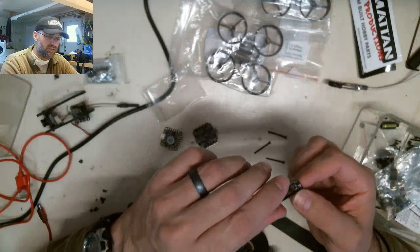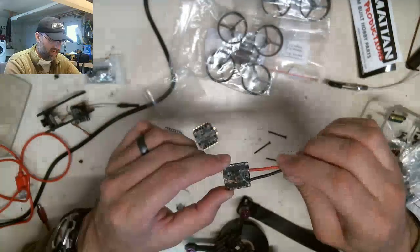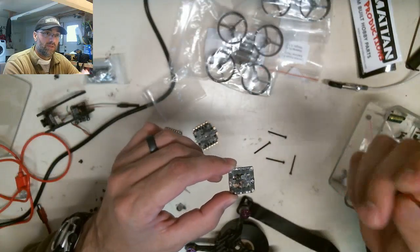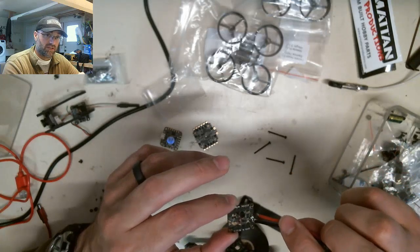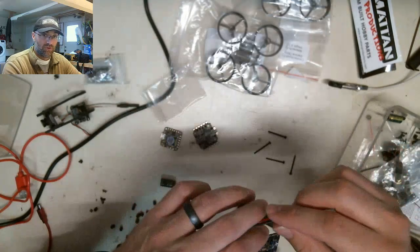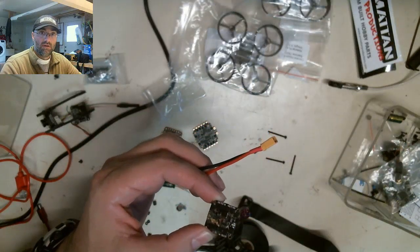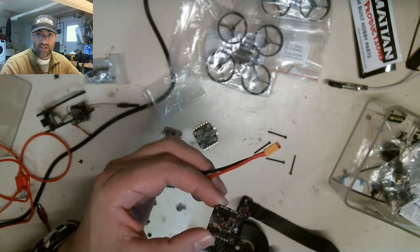The first thing they told me is the polarity was wrong on this chip. They said that I crossed the positive and negative leads. What they didn't know is that the lead still had the shape from the solder pad, because the solder pads are still good on here. Surprisingly, long story short, they were wired correctly. Went through the video, looked at all the video, 100%. I didn't mess this up. It was a bad board.